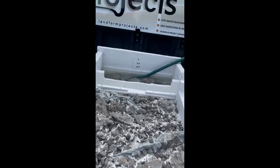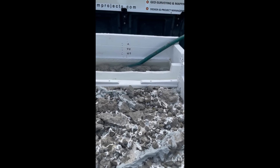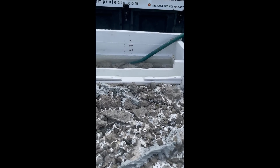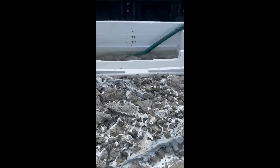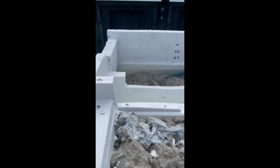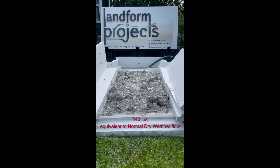I've put some little wedges on each side of the weir crest because of the fish pass guidelines, just to see what effect this has. The Fish New Zealand fish pass guidelines say the weir should be V-notch, which would encourage larger fish to swim through a deeper current in the middle — which is counter to what we really want. So I've done a modified version where the sides slope in a bit and there's a section in the middle, with rocks in front. The flow from the hose is 240 milliliters per second, equivalent to 240 liters per second at full scale, representing a normal dry flow condition.